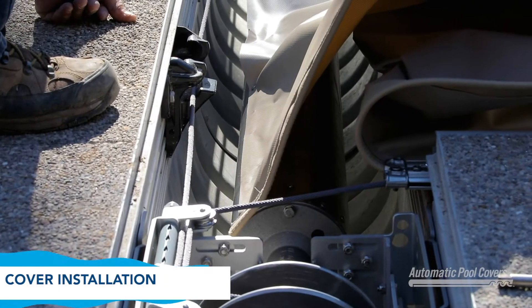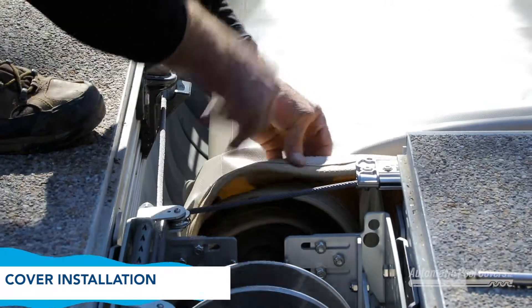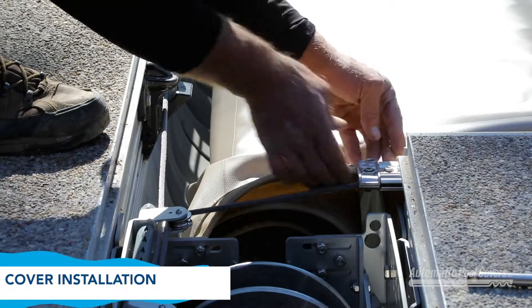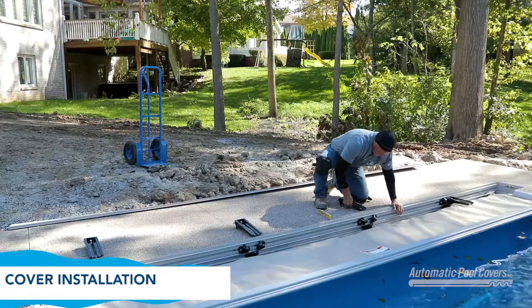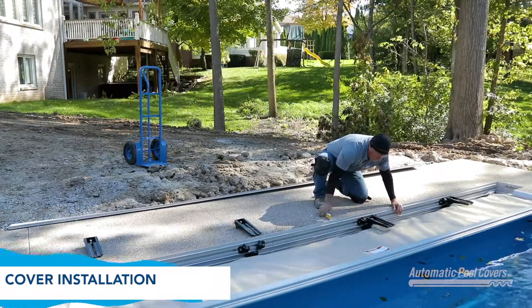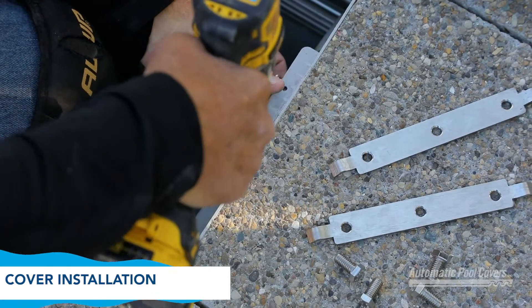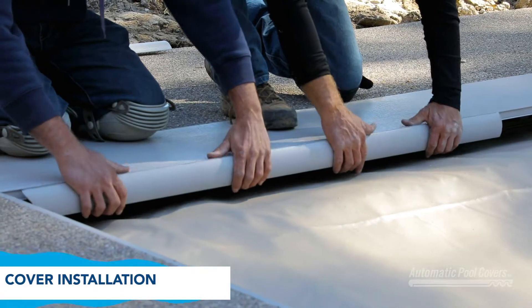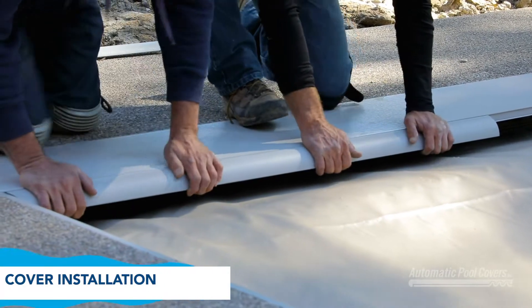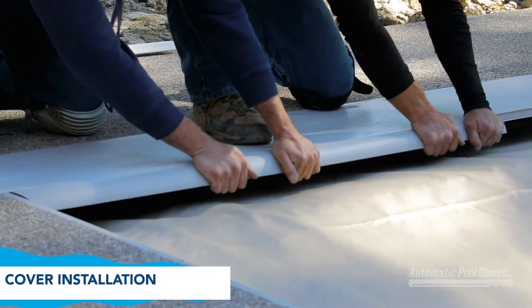Use the controller to open the cover enough to take up the extra length of cover loosely around the tube. Cuff the edges of the cover at each end. Open the cover completely. Reinstall and level the lid bracket arms. Assemble the lid seam support bracket and lid lock components. Attach left and right fascia by placing into the channel on the front of the lid, bottom edge first, and then tilt up and in.